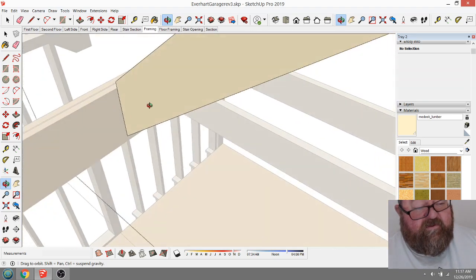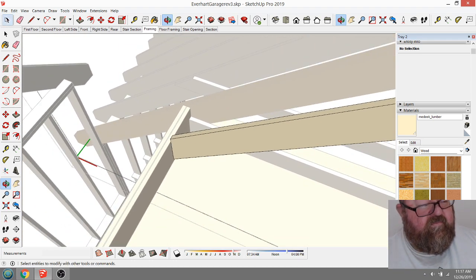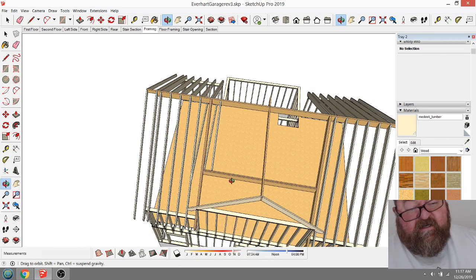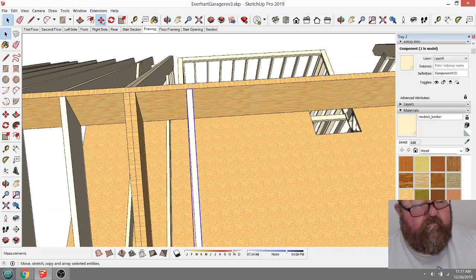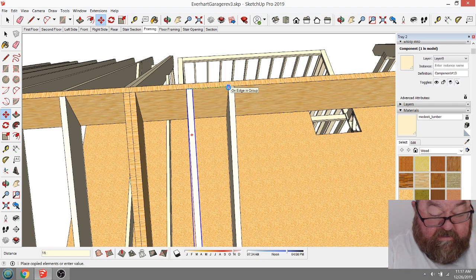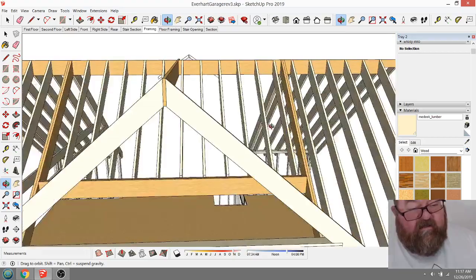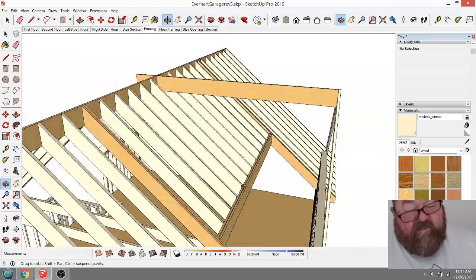They'll have a joist hanger, probably like what you'd use for a 2x10 deck or floor joist, though we'd call it a rafter hanger in that case. And then I will have probably another 10 or 11. Let's just go 10, times 10. There we go. I just copied those across like that. See that? I just created 10 or 11 little common rafters that would fill that in really quickly.